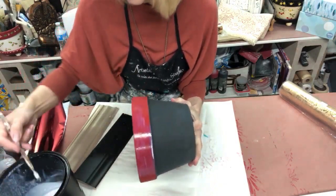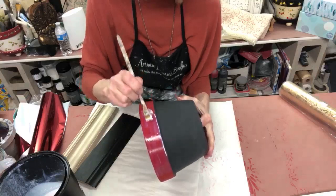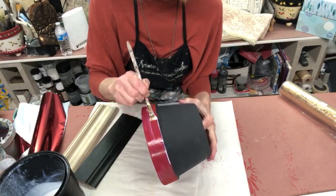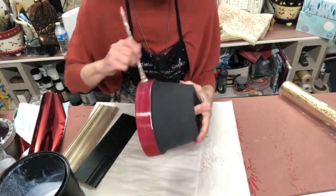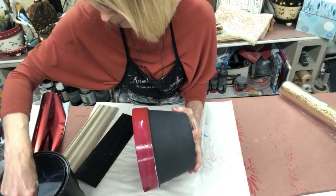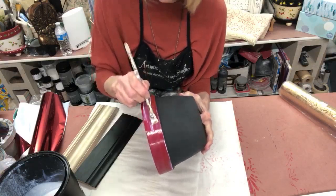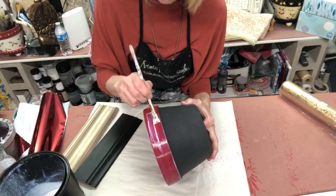It is water-based. Your brushes will clean up and your rollers will clean up with just either warm water or soap and water, okay? If you feel that it still has a tacky feel, you can always add a little bit of soap and just rinse them off. I do try to clean up any of my tools that I've used with adhesive, just because it is a glue. I always try to clean them up relatively quickly. Not that I say that, I've got a bucket of them over here next to me right now that need to be cleaned. But make sure that they're soaking in water and don't just let them sit, because you could possibly ruin something, okay?